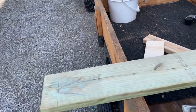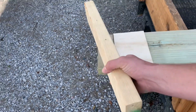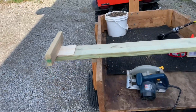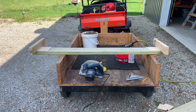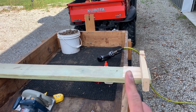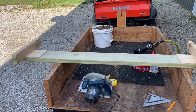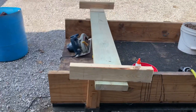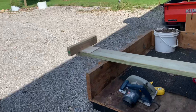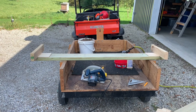We're going to do that on each side — this side is going to be the same thing. I've marked out where the skid should hit, and what we'll do from there is we'll lag bolt our wheels with long legs — one side of the wheel will be a long leg into the 2x4, the other side will be a shorter leg underneath. That will attach the wheels to this dolly frame, and then I'm going to drill half inch holes in the sides of each one of these and I've got pins that'll slide in there to keep this thing from wanting to fall off or move.